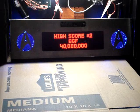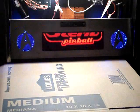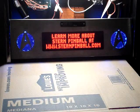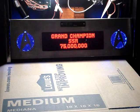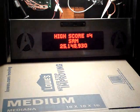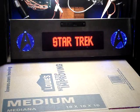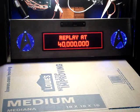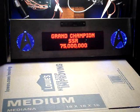with the speaker bolted up tight against the back of the speaker grill. The only way any light could get in was from that one flasher bulb, and it would have to get in through the edge of the blue plexi, which they call a lens, I believe, in the manual. It's the only way it could get any light. And while you did get some light in there, it's nowhere near as bright as it is with the extra LEDs. And with the speaker mounted a 1/2 inch off of the grill, that gives you that 1/2 inch gap on that top side for more of the original flasher bulb light to get in the speaker. So that's it for now, until we get around to pulling it back out and putting a color DMD in.